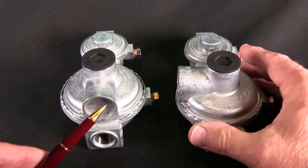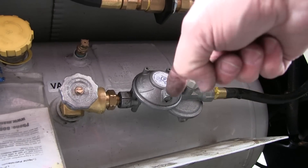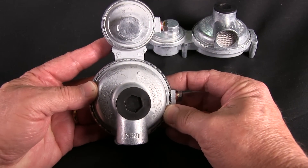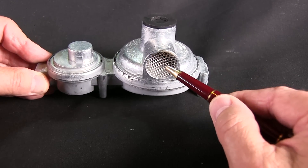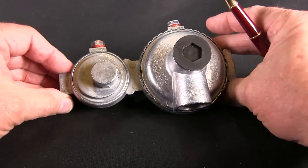This one is designed for an ASME tank application, but there are still differences with this style as well — it's all about the position of the second stage vent. As you can see right here, it's a code requirement that this vent be positioned downward when the regulator is mounted, at least within 45 degrees of vertically downward. This regulator therefore must be installed vertically, which is not applicable to most ASME tank configurations. I always advise coach owners to carry a spare regulator, especially if you like to dry camp in areas away from civilization — be sure your spare has the correct orientation of the second stage vent opening for your particular application.